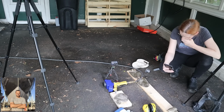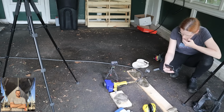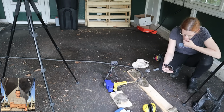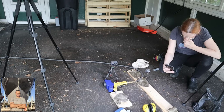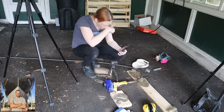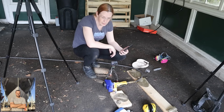Okay. Honestly, I've used river sand on everything. Aluminium, wood, steel, stainless. I just use it on everything because it gives you the right key. Okay. So river stone or garnet is what I need. Yeah, don't ignore the river stone. That's just what we call it because that's what the garden shop sells it as. But it's basically garnet. All right, well, I'm going to pack up and see if I can find a place that I can buy some sand on a Saturday evening.